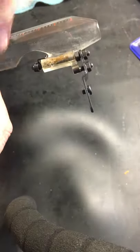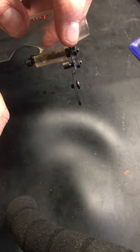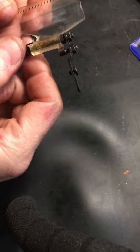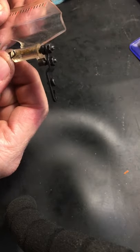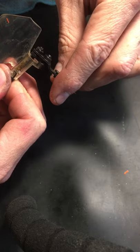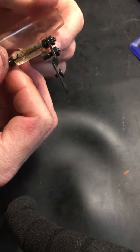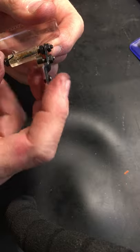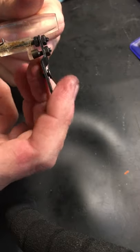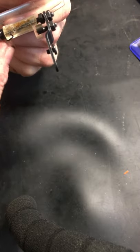So what we need to do is take a quick look at this system and see how everything goes together. There's a rod that goes through the middle, there's a spring here, and it needs to be attached to something because right now everything is freewheeling — not doing what it should. This piece right here holds the whole side arm to the center rod with the spring assembly. We need to tighten this in between the two nuts so it's super tight — that way when this moves the spring doesn't go anywhere it's not supposed to.